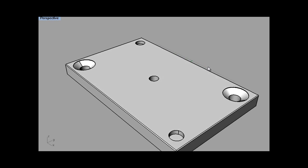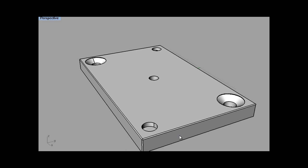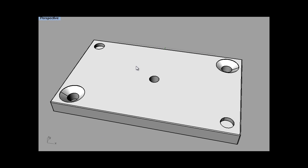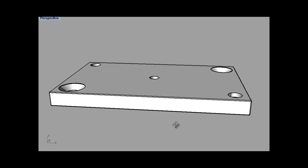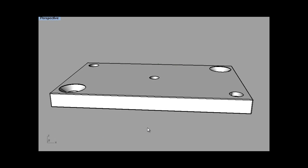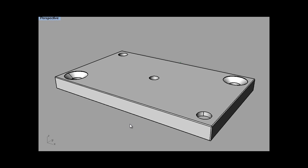But how I'd start about it, I'd make a plate up on the milling machine, sort of like this. Dimensions, you can work out for yourself what suits you best, but bear in mind it's only to machine rings, it doesn't have to be massive. Now you could do this out of aluminium, which would be ideal, but also you could use plastic or even a plastic worktop, chopping board, or Corian if you could get hold of it. It's nice to work in as well. Small pieces sometimes come up on eBay and whatever.